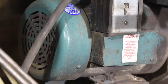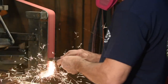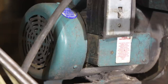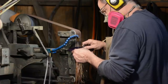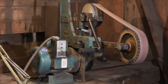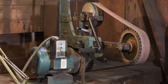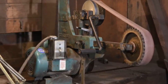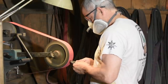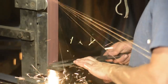The next component of the grinder is the motor. The best grinders typically have motors in the one to one-and-a-half to even two horsepower range. My Bader has a one-and-a-half horsepower Leeson. Even more important than the horsepower is the overall quality of the motor. Grinders exist in a really nasty, gritty, wet environment — show me a knife maker with a super clean grinder and I'll show you a guy who doesn't make many knives. High quality motors from name manufacturers like Leeson and Baldor will work better and last longer. The motor on this Bader has lasted 15 years of fairly heavy use with zero maintenance and still works as well as it did the day I bought it.